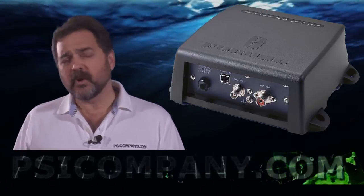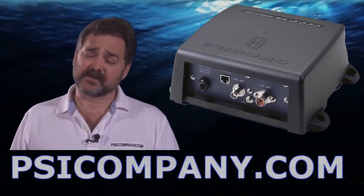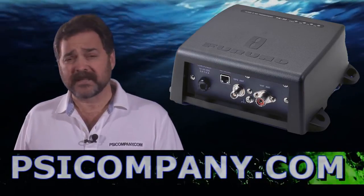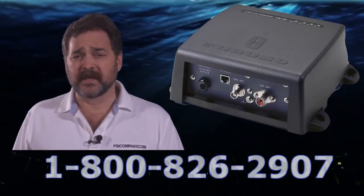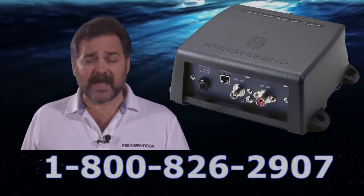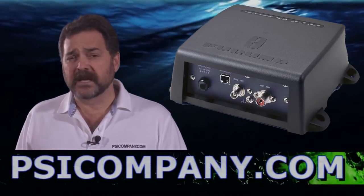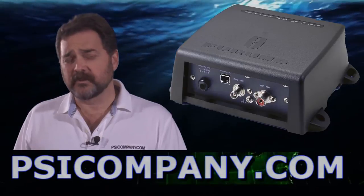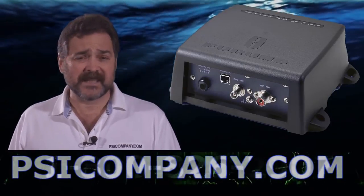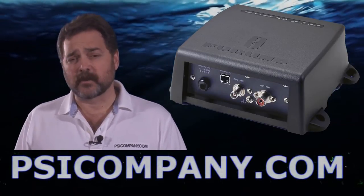When you're employing AIS, you have the benefit of being able to see ships around you as locations. You can see the ship's call sign, their MMSI, the type of ship, the location, the course, the speed, and the heading. If the ship is carrying hazardous materials, there'll be warnings on that as well. It also gives you the ability to view text from preset safety messages that are integral parts of the AIS network system.